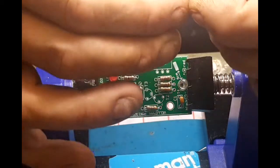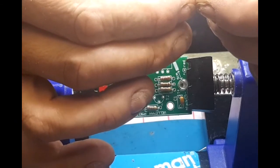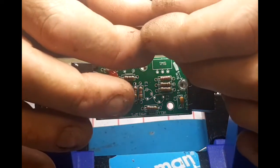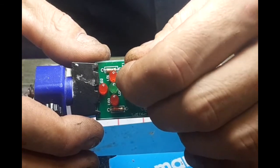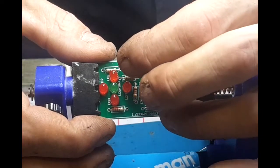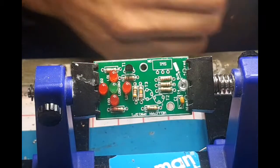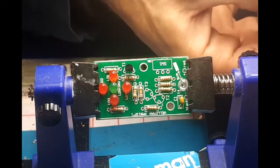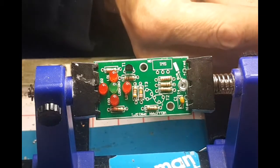So, and we've got them in the tripod standard, as I like to call it. So T1 is up here. Again, polarity, base, collector and emitter, two of these legs you can get wrong. The middle one's always going to be right. But you've got a round edge and a flat edge, and the board silkscreen will match that. So just get the shape matching the shape, and you can't go wrong. The 557 has been clearly marked as different with a white label on it, which was nice. I shall show you that.